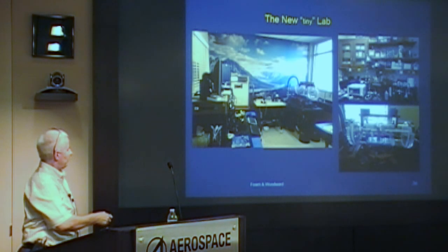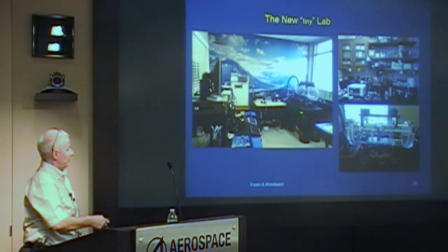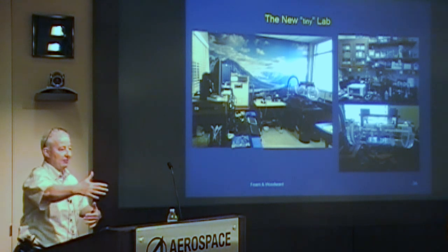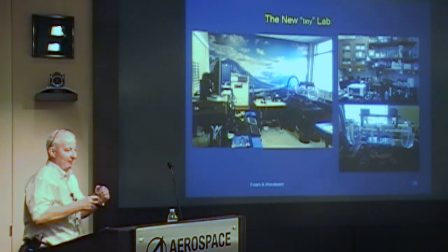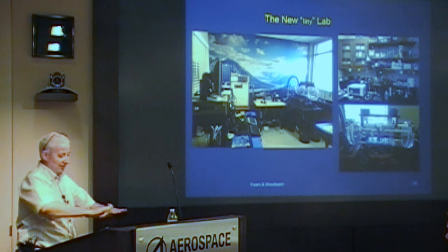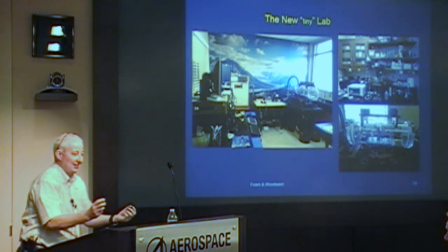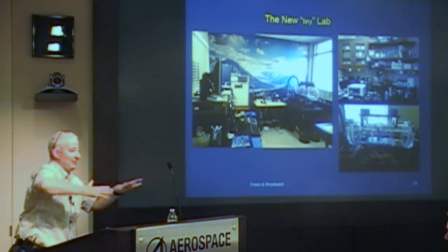Now, that thing was fairly large. It would probably take the space from here to about here, beyond the podium. It was much too big to fit in this little room. So I thought I was doing a big favor by getting some really fancy optical table legs with a pneumatic system. Of course, over here underneath the vacuum pump is a little compressor. This would float this granite, which was 6 inches thick by 2 feet by 3 feet, just big enough to hold the device. I was thinking, great, we've now got this wonderful optical table, and I'm going to float it up, and it will be perfectly balanced, perfectly flat, and take care of itself. And I inflated it, and I was adjusting the little screws, and this thing was tossing and turning and bucking like a bronco.